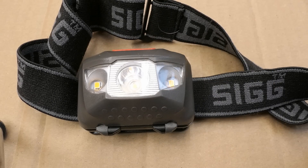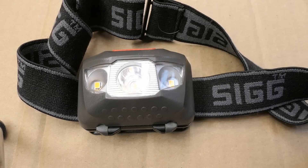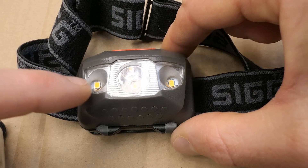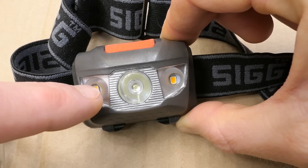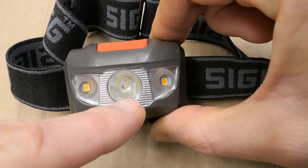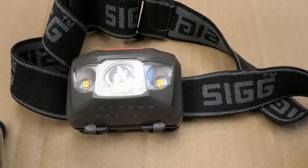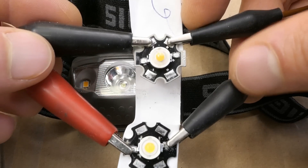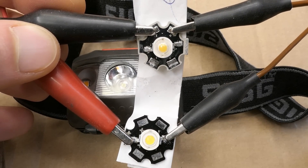The Z-lamp is not yet modified enough. I've already replaced the super dim red LEDs with phosphor-yellow LEDs, much brighter and much more useful. I've spray painted the black reflectors using silver paint, because it surely makes a lot of sense for a reflector to be black. But even the main LED is not going to be saved from my modifications. This one is super cool white, which I don't like. I want to swap it for a warm white LED, which might also happen to be more efficient — definitely a great bonus.